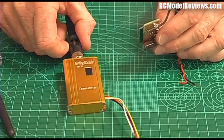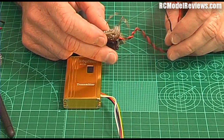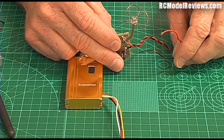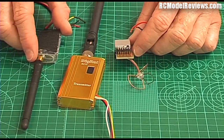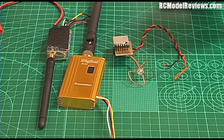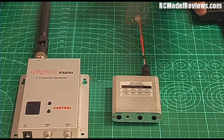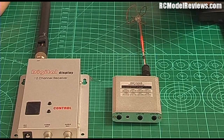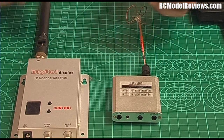So those are transmitters. Most of these will chew a bit of juice — you can run them off the main flight battery, your LiPo, or you can provide a separate battery, but whether you do that depends on a number of factors we'll look at later. Having a camera to capture the image and sending it down via a transmitter is only half the solution — we must also be able to receive the signal, and that's where receivers come in.